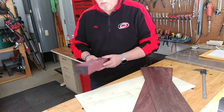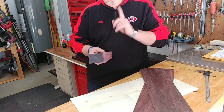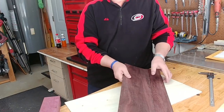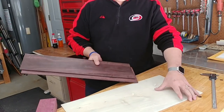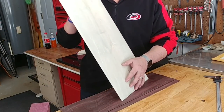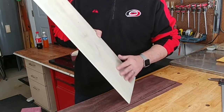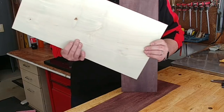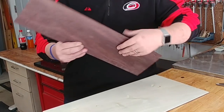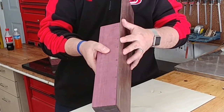We've got these large planed and machined blocks of Purple Heart, and they're going to be glued to the neck blanks. But before we do that, we're going to create some veneer contrasting stripes in between them. I've chosen a couple of boards: this is Mexican ebony — it's called catalox — and then this is a very special wood called Hollywood. It's from the holly tree. Gibson used to face their pegheads with this on 1950s Les Pauls because it finishes so well. It's a light bluish-gray color and a very good contrast to the darker Mexican ebony. I'm going to cut one and three-quarter inch strips of this wood and glue them to the Purple Heart so we get a nice contrasting stripe.